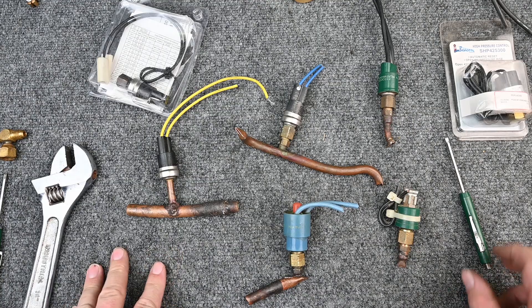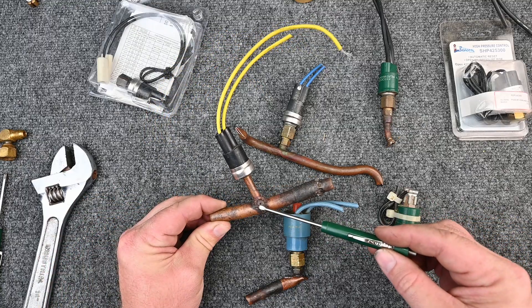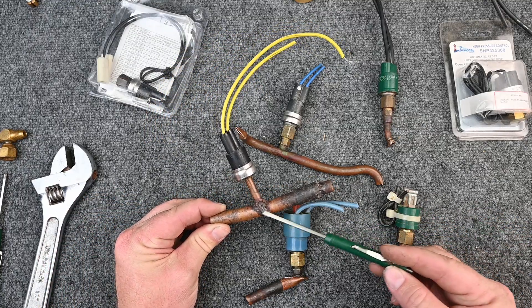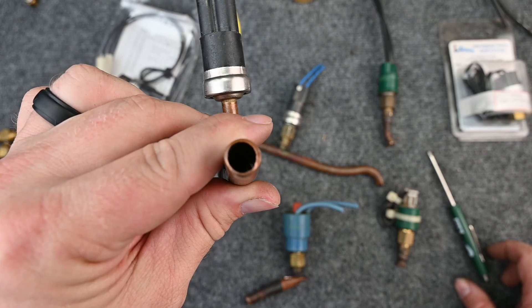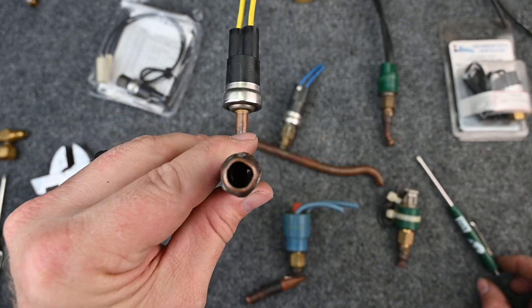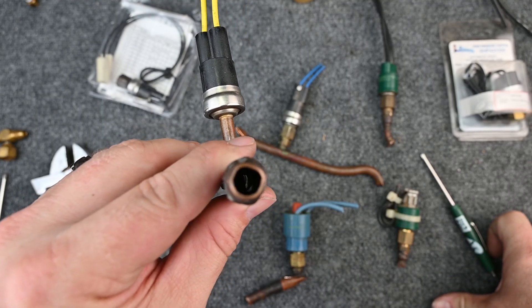When you have to replace one, these are nice because they have threaded fittings — always use the backup wrench when taking this off. Here is one that's brazed in; a lot of manufacturers do this, but this one is not a factory braze. If we look inside this fitting, it's really dark — hardly any light showing on the other side. The problem was when they drilled the hole and installed this piece, they pushed the pipe all the way to the very bottom.